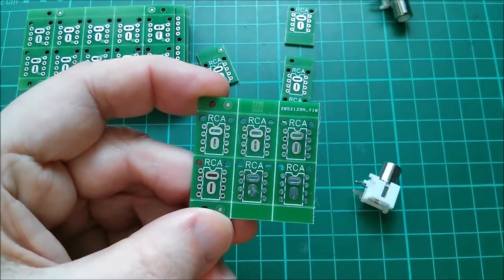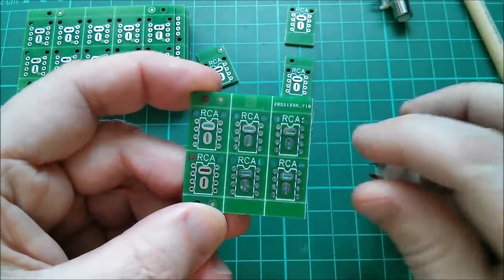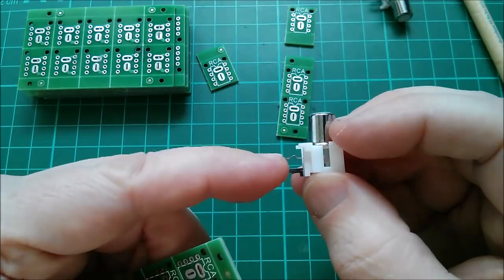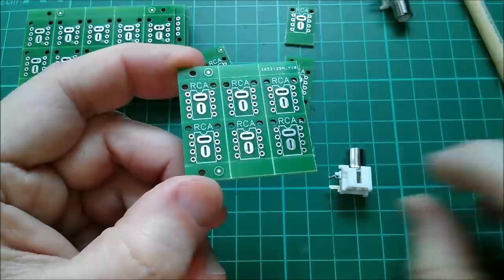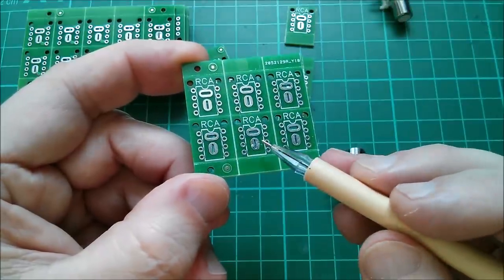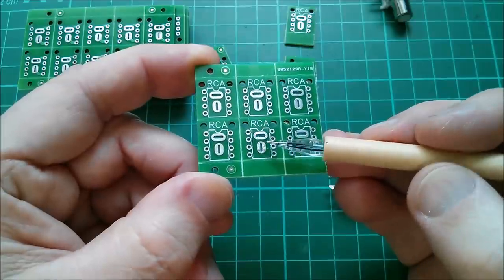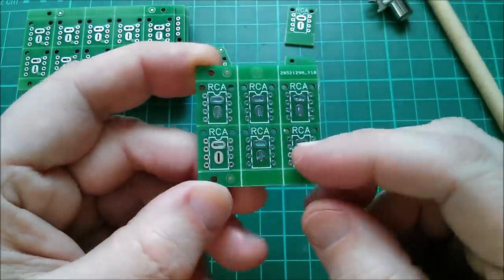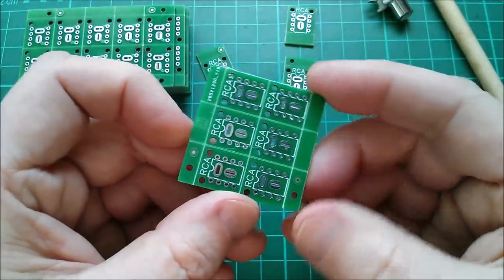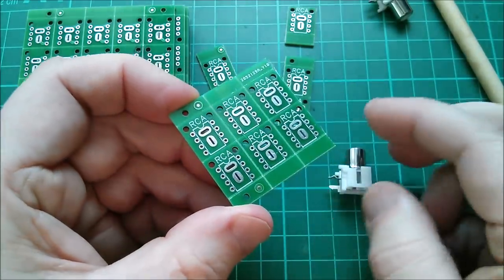I had to make this slot at the back wide enough to accommodate both the bit with the barb, but also this fat bit at the top. On this board I've put a relatively wide slot here - I think it's a millimeter - that caters for the little bend in the grounding pin. And then I've put a very narrow slot; this is actually only half a millimeter, so that must have been drilled. They didn't query it, so this has come back with my slotted pads.